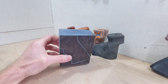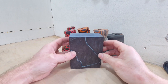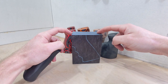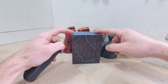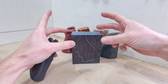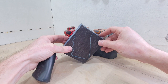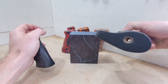This is a bit of birch laminate, 55mm thick. I've drawn around it just a little oversize and this is what we're going to chop out and turn into the grip. As much as it pains me to say it, when it comes to making items like this it actually pays to be a little bit wasteful with your wood. Keeping this square for the moment means we've got much more to clamp in the jig. It'll allow us to keep it true when we're routing out the top piece, and it'll also allow us to clamp it on an angle when it comes to drilling down through for the fixing bolt that goes through the bottom.